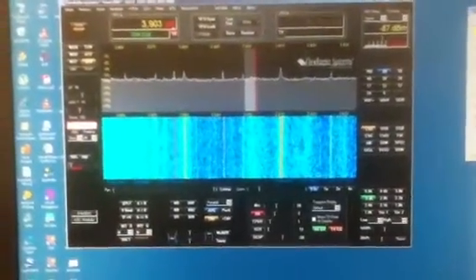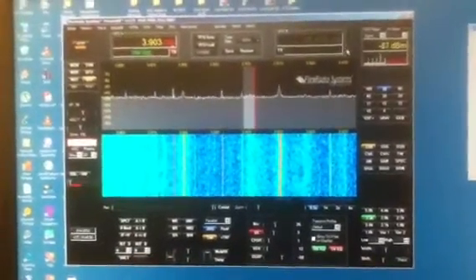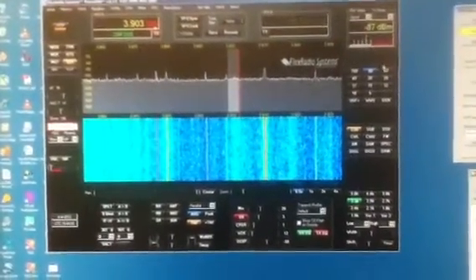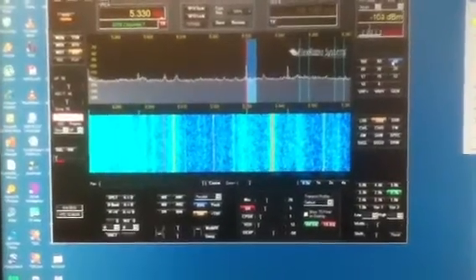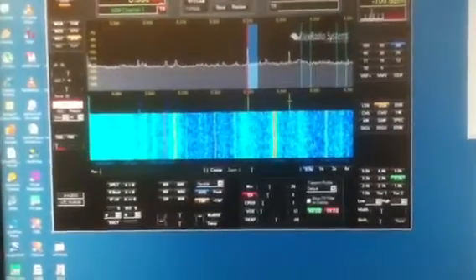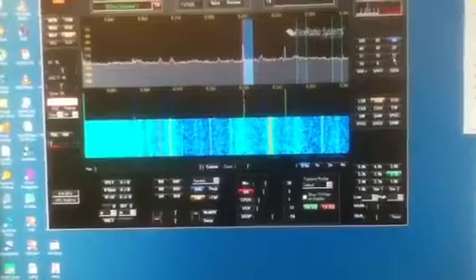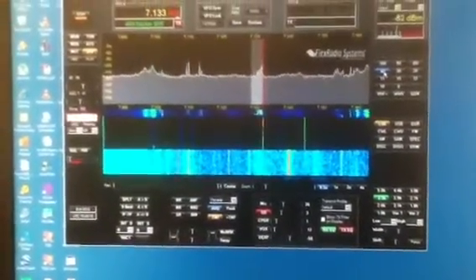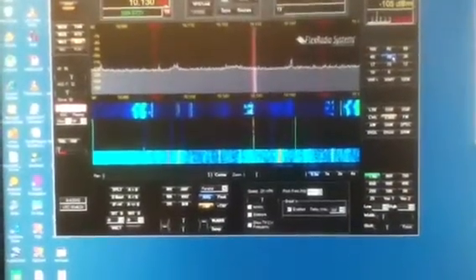Recording to show interference. The TV is off right now. On the 80 meter band and 60 meter band, you can see the black background — very low noise. 80 meters typically has some noise. 40 meters: low noise. 30 meters: very low noise.